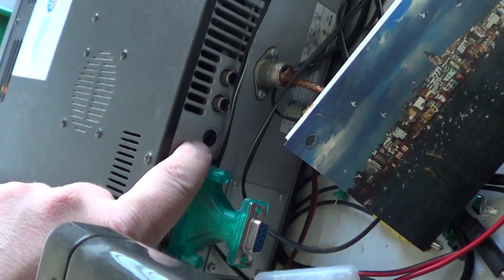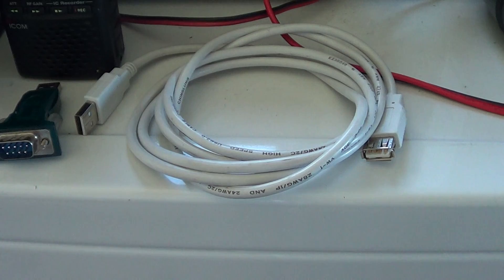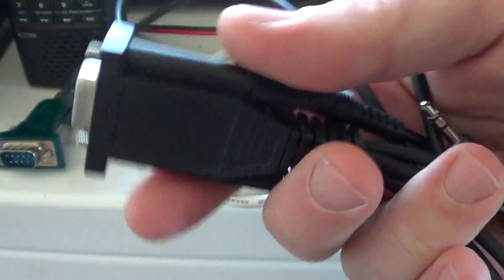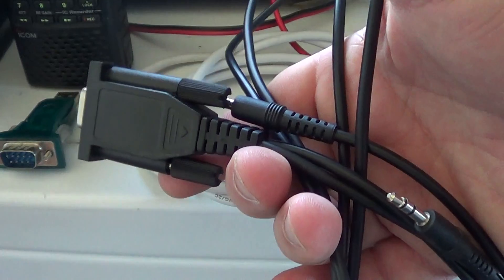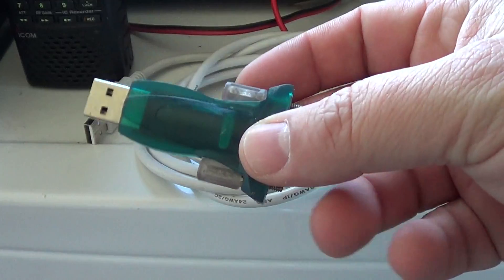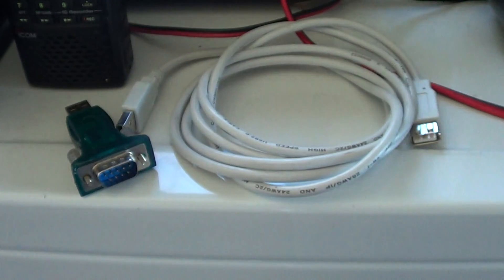It uses the same cable, so if you have both radios like I do, you can actually control your receiver with only one wire. All you need is this little adapter with two plugs at the end. This is what is called a CIV adapter for ICOM radios. It's pretty much universal and works with many other models of ICOM radios because the CIV connector is almost universal among ICOM radios. But keep in mind you still need serial to USB if your computer does not have a serial port.